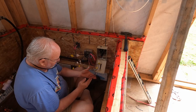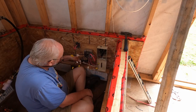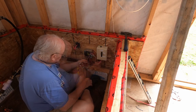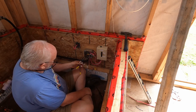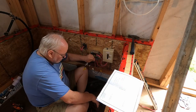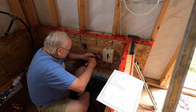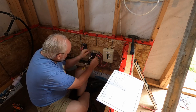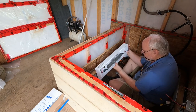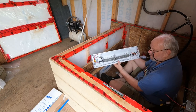So the lights are going to be this circuit here. I don't have that tied in the box yet so now I have to feed that in the box somehow. All right, that guy's going to go in there — right in the black here on this three conductor. One of them is going to go for the lights, one of them is going to go for outlets. Okay, so here's my heater. It's 24 inches long, it's a 300 watt 240 volt, takes 1.25 amps. So that's good — not much of a load. I like that.